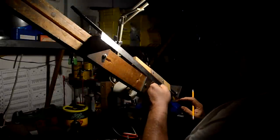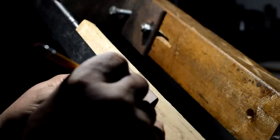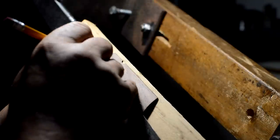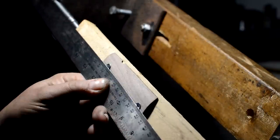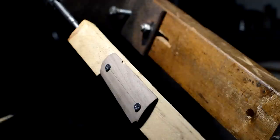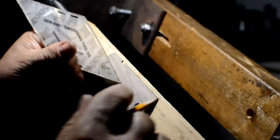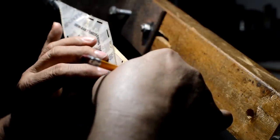So as we've seen in previous videos, we've got to have a center line. Traditionally there's a diamond that runs around these two grip screws, an uncheckered diamond. In this case, I very lightly marked a pencil line, because if you push, you will actually create a dent here, and I haven't. This is a stupid soft pencil. Because of that, and we want about 3-to-1s, and these 3.5-to-1s are too pointy, right through the center of this thing we'll lay a 3-to-1 on it right there. And this is where our master lines are going to go.